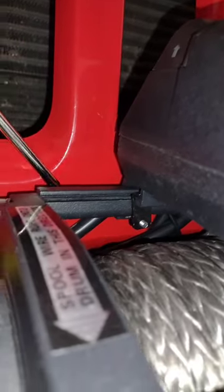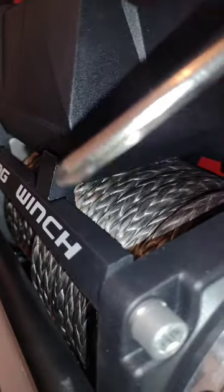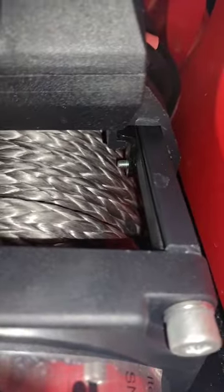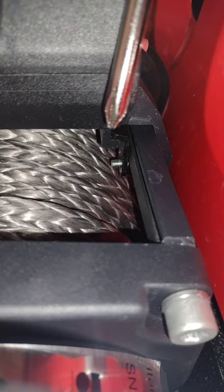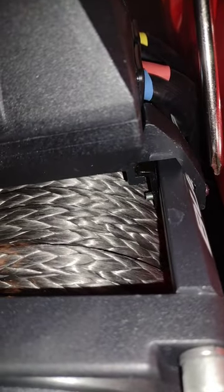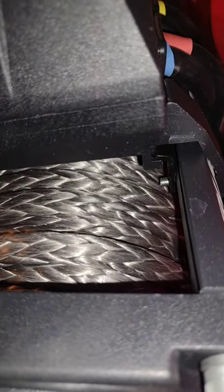To mount your electronic control box you'll find these two metal black tabs and screws. The electronic control box is attached to these black metal pieces — one there, one there, and then two on the other side. Those slip into these tracks, one on the front and a track on the back. It will fit loosely and allow you to move it side to side to position it where you want it mounted on the top. Once you position it, take these black tabs and slip them in between that L-shaped metal piece on the electronic control box. They'll sit there and hang very loosely. Take the screw and screw it in from the back side, fish it through the black tab, and once you get it snug that screw is going to tighten from the bottom, which pushes the top of that black piece towards your electronic control box and tightens it up really snug. You've got to do that twice — both there and right there.